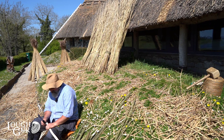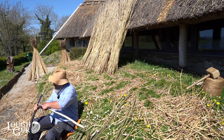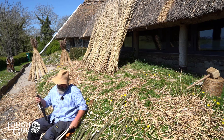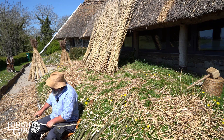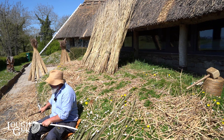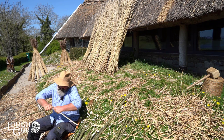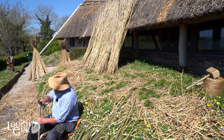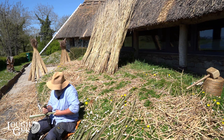This is the willow gathered yesterday from the marsh, brought up and processed for thatching. You're splitting it into what are known as 'scualloga' — scallops in Irish, spars in English. Willow or hazel were always used because of their lovely straight grain, so they split quite easily. The long fiber means the wood twists like a rope instead of snapping when you twist it, making a lovely staple for the roof. This is exactly how they would have thatched thousands of years ago. Freely available near water, there's a beautiful thing with nature when it comes to keeping you dry.